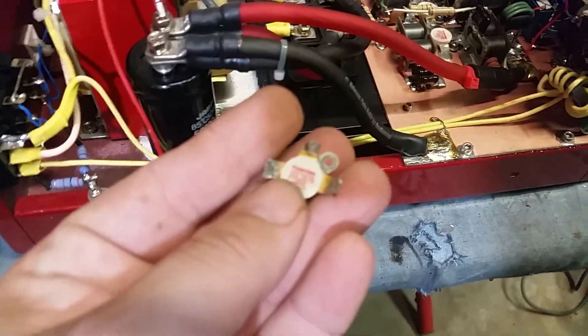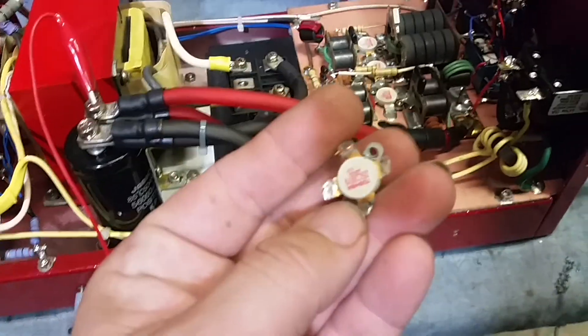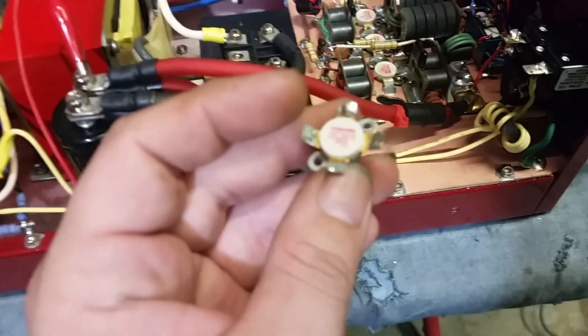It had a blown 10-ohm resistor. The 10-ohms are these small resistors right here from the base — this resistor right in here, a little brown-black-black. You'll see all of them have a brown-black-black. That's the one that was blown right there. It appears that you bought this transistor brand new from RF parts, and I hate that you had to spend that money on this.